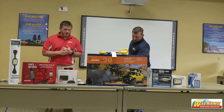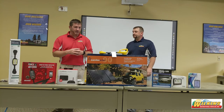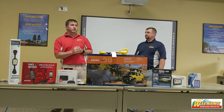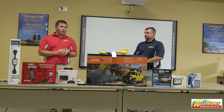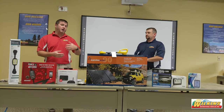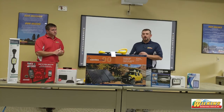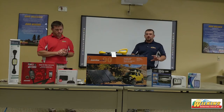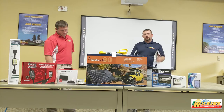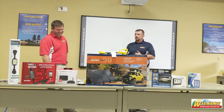Let's talk briefly about generators. With motorhomes, generators are tied to the vehicle, so you can run the generator while driving down the road and have 120-volt electricity — run a coffee pot, the refrigerator on electric, or a television in the bedroom. When the generator is running, it creates 120 volts and also converts that to 12-volt power, charging the batteries. On drivables, people will also run their generator and turn on the coach ACs to cool the whole coach down, especially if traveling with pets.